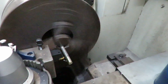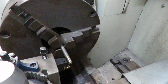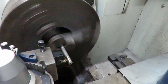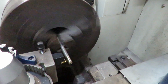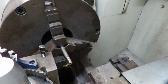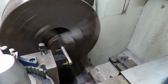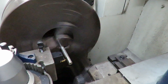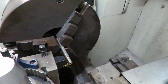There we go. Back in again — another one just for good measure. Those of you who are interested, we've already got 270 RPM but it's not very fast based on my machining threading. This is stainless steel, by the way. One more time just for fun — because it's a fine thread I don't mind doing quite a few spring cuts.